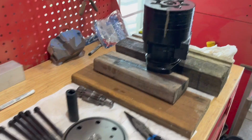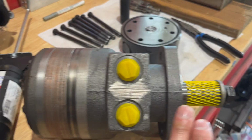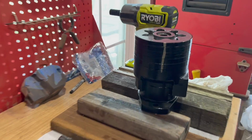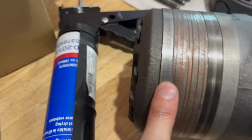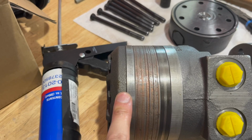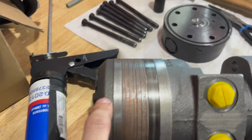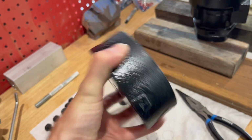And if you look at the two pumps, basically this one is the same all from here all the way up. This is where all the damage was on that plane right there. This was the piece above it, and then that is our little star top one there, and then cap. So on this one, the regular one doesn't have the internal bidirectional relief valve, and this one does. So the option is basically a different cap on top.